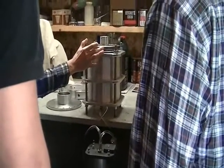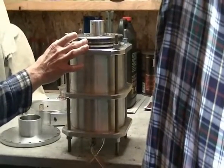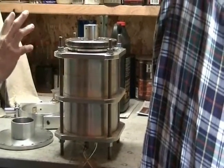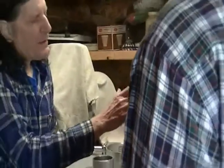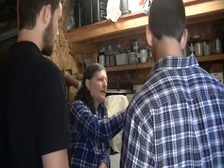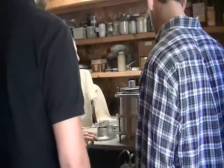Are any of you into aerodynamics? This works through aerodynamics principles rather than a typical turbine. The principle between these plates is that air, or any gas or fluid, will adhere to the discs. Once you inject air between the discs, you get a reaction due to adhesion rather than the typical impulse or reaction you get from conventional blades.